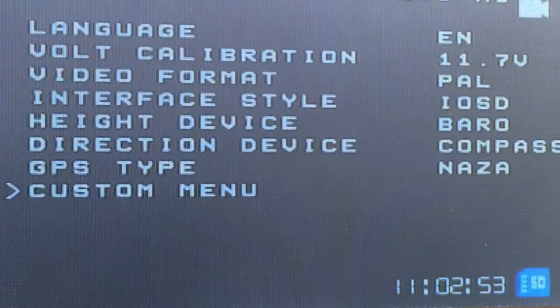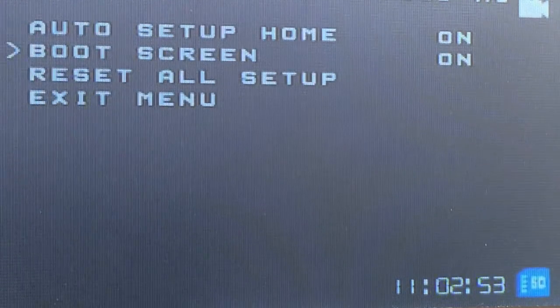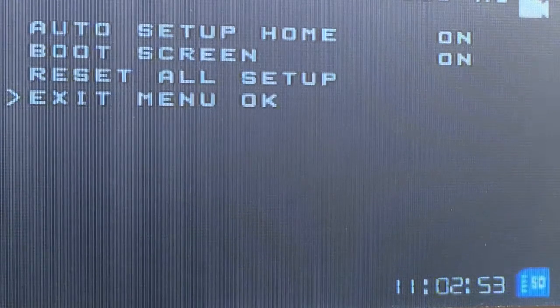To go back to the main menu, press and hold. Short press scrolls through options, long press actions them. When you exit the menu it saves all your settings, reboots, and everything comes up in English. There's a little circle at the top of the screen — as I rotate the quadcopter you can see it change to an arrow, and when you're pointing back on target the circle reappears. The home point is wherever the craft is currently situated.